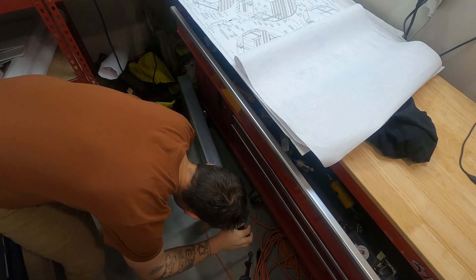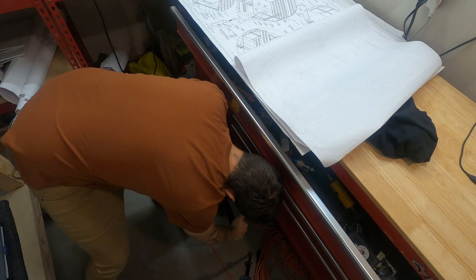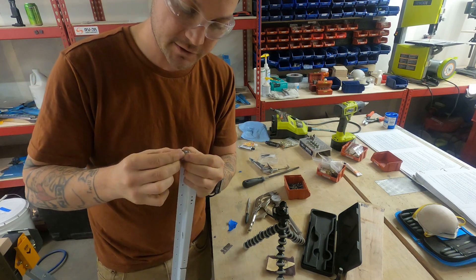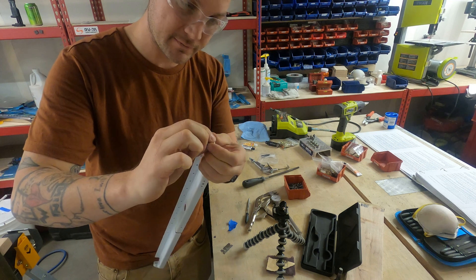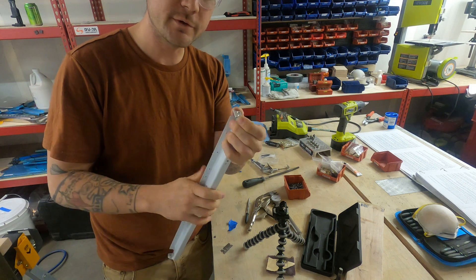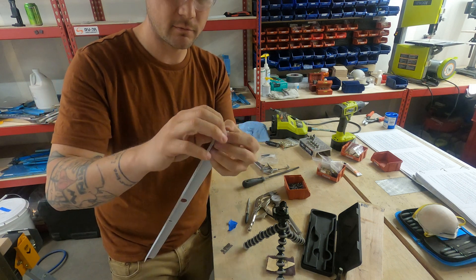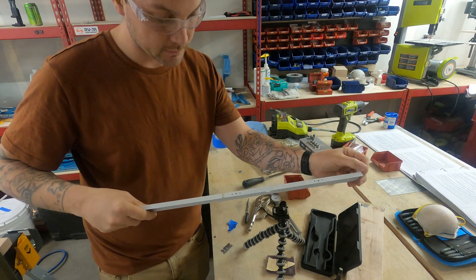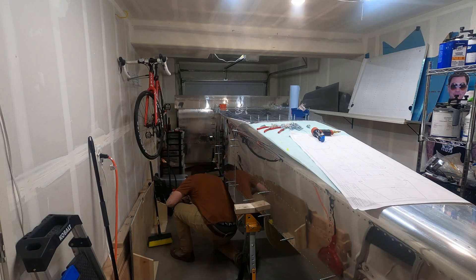With one exception — I need to dimple some holes. So we go ahead and dimple it, and then the piece is perfect. Now we have a little spacer that just fits perfect and takes up some of that gap between the two pieces. We'll use a bit longer of a rivet, but otherwise everything else fits perfect. So I'm not too worried about the inclusion of the spacer.